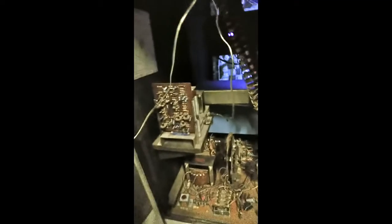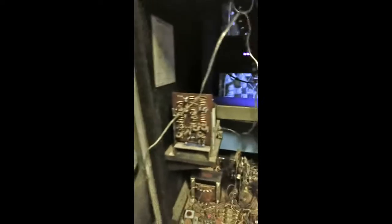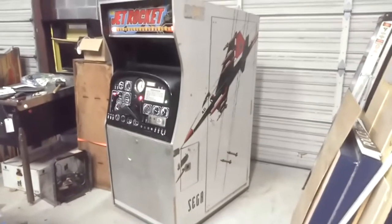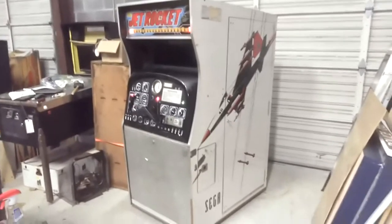I got the sound cards rebuilt — the power supply for the sound rebuilt — and all the ambient static, noise, and hum is now gone. The machine is on and before there was just a constant hum; now it's not there. The sound for the Rocket actually sounds better and is working better — a much-needed upgrade. The only problem left to solve is the far-left target; as soon as I get schematics I should be able to figure that out.